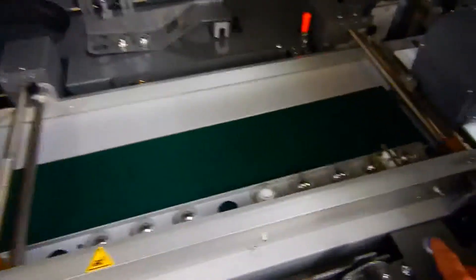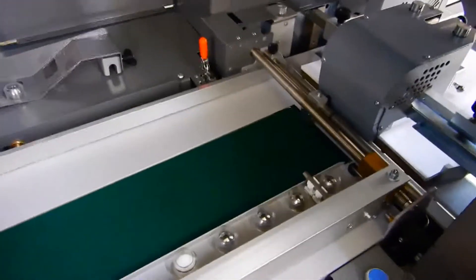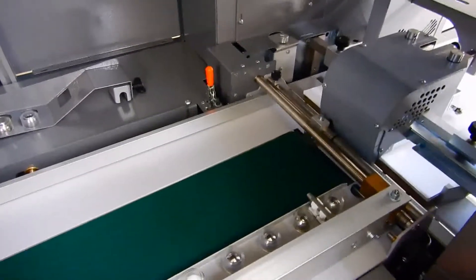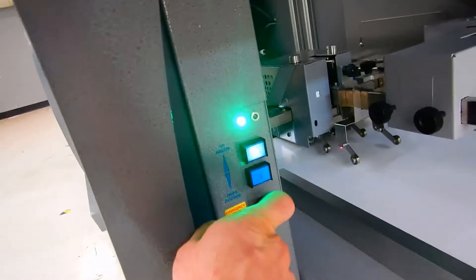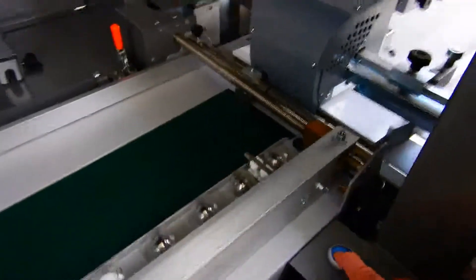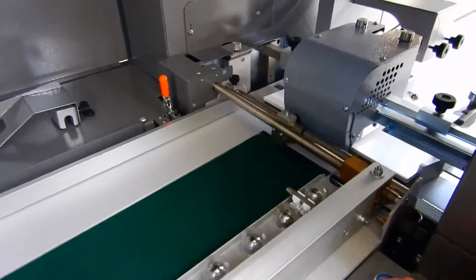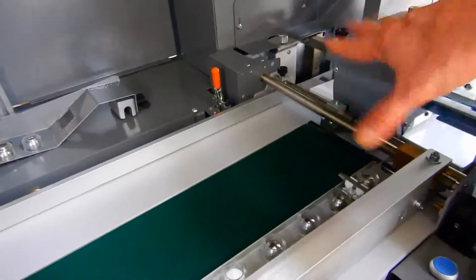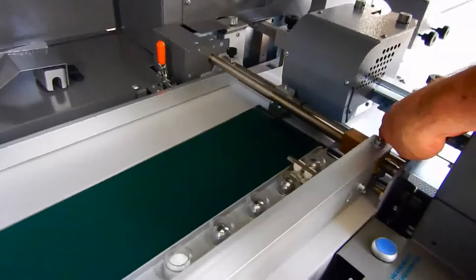Once you're all set, you can come over here and activate it to see how your vacuums are doing and how you're going to fare with feeding your paper. Give it a second. If it's in a different mode, turn it, push it downward, push it upward, let go — then you should be in auto mode. Hitting this will show you what suction you're getting on your paper, how it might feed, and whether it separates a single sheet or not.